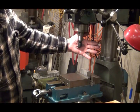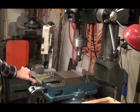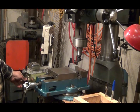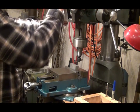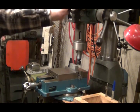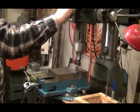I've got a little fly cutter set in my R8 spindle. I've not done a lot of machining with aluminum - I know it's a lot easier than steel. I want to get a nice finish on this. I'll center it up a little bit just by eye and go down until I touch. I just barely want to skim it off, just to straighten it up and clean it up.